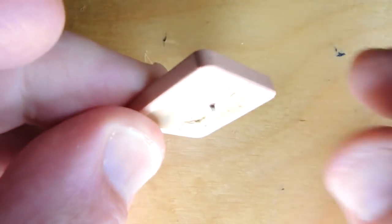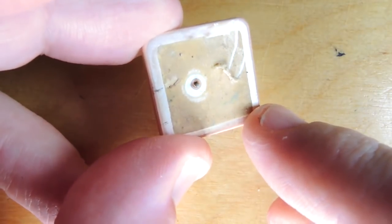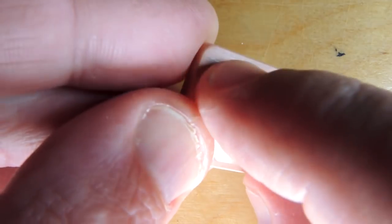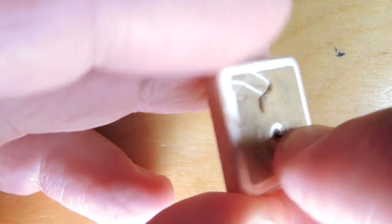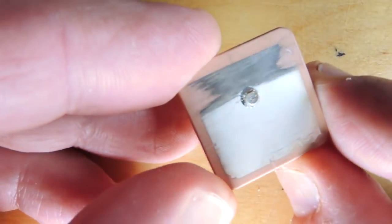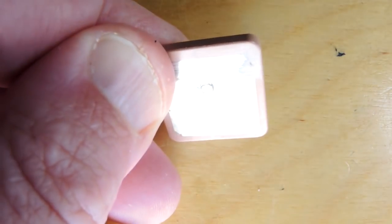This is the antenna for the GPS unit. It's a chunk of ceramic with two metal plates, one on each side — known as a patch antenna. You can see I sanded away the metal here; it's just been placed on this side of the ceramic, and then there's a through-via with the metal contact that goes down to the assemblies on the circuit board. You can see it's isolated from the ground plane. These are surprisingly inexpensive — you can purchase them off Digi-Key for about two and a half dollars for a single unit quantity.